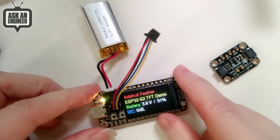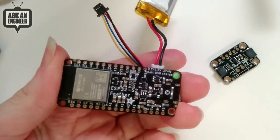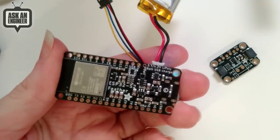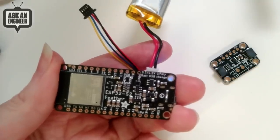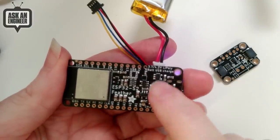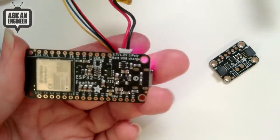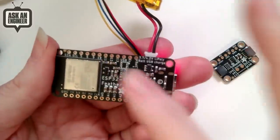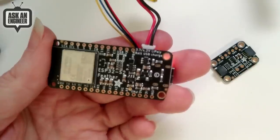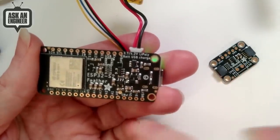This little demo is scanning the I²C port — when I unplug it, the I²C device disappears. There's a NeoPixel on top. On the bottom is the ESP32-S2, which is a single-core Xtensa 240 MHz processor with built-in Wi-Fi. It doesn't have Bluetooth LE or Bluetooth Classic, and it's only single-core, but it does have native USB, meaning it can act like a keyboard, mouse, or disk drive and works with CircuitPython. There's a battery monitor chip on I²C, and the TFT and I²C port are on separate low-dropout regulators so you can fully power off external hardware to achieve really low power — about 80 microamps in sleep mode.